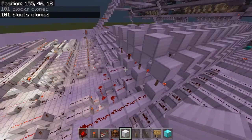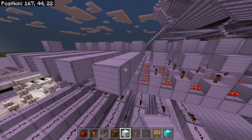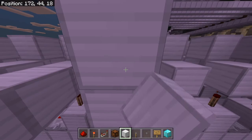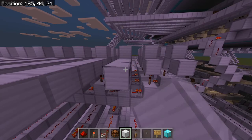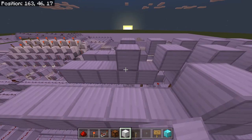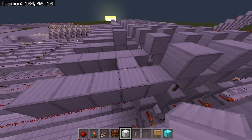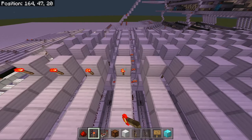And now I just need to fill in the codes as well as building these kind of outputs. So each of these lines represents a different instruction. As we saw in the final couple of design episodes, we now have 16 signals, one for each instruction. Only one of them is on at a time. They come directly from the opcode register, so when we save a new instruction into them, they'll immediately start getting decoded while we're doing the program counter increment.